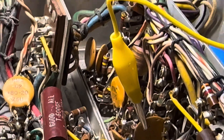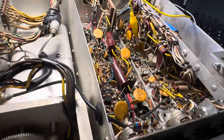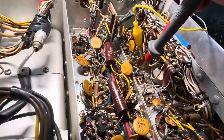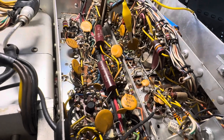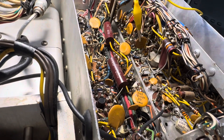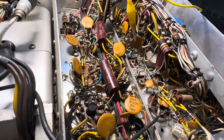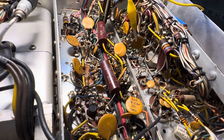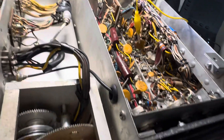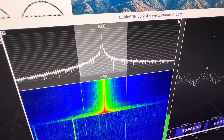That gives me an opportunity — I can hold the meter on there and see if I can make it transmit. Let's get this thing working. I'm going to try putting a tuning tool in there and see if I can turn it a bit. I could also bend wires to change the capacitance, but it's on the fringe and not working. Let's see if it's on frequency — it's pretty much dead on 8 MHz, pretty close.